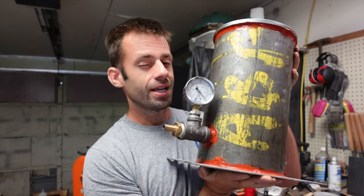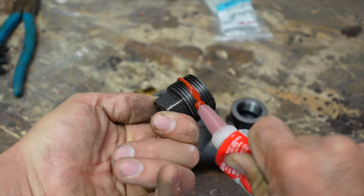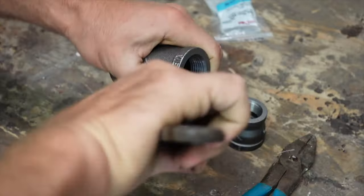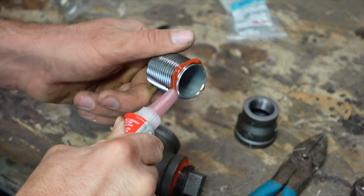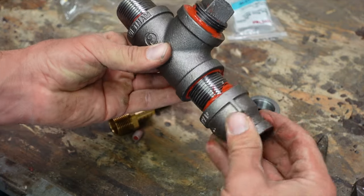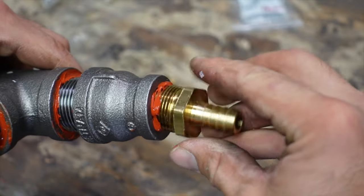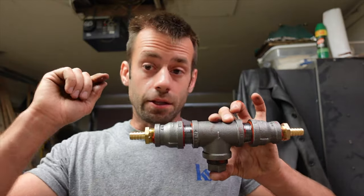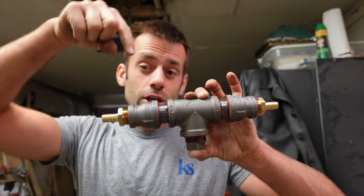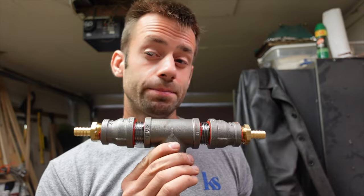One last thing I'm going to do before I use this is make a safety feature, kind of like a P-trap. I picked these pieces up from my hardware store — they're sections for gas line connections. I don't really like having this many threaded pieces where there might be air leaks, but if I give them a good coating of silicone rubber and screw them on, all those places should be airtight. Now if I do have another blowout, the bottom of the chamber will act as a reservoir to hold most of the molten metal. But if something splashes and gets sucked up the tube, I wanted to have a secondary protector for the vacuum pump. The theory is: if any metal gets sucked up into the smaller tube, it goes into this open chamber, drops down to the bottom, and does not continue directly to the vacuum pump — just a little extra safeguard to keep that expensive vacuum pump working.